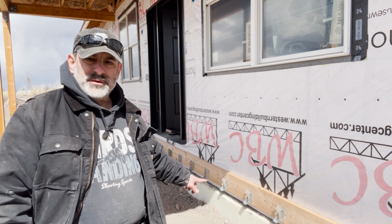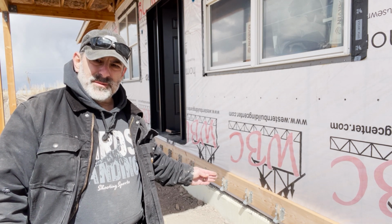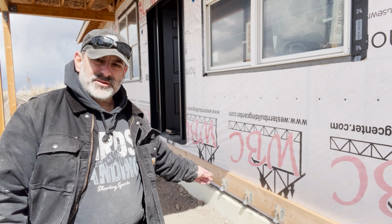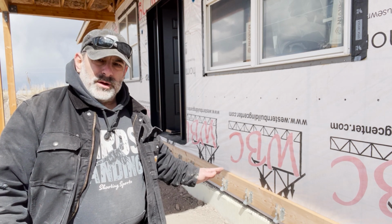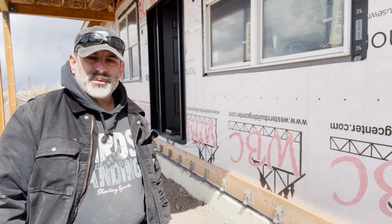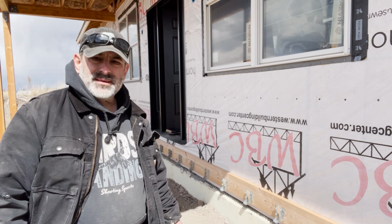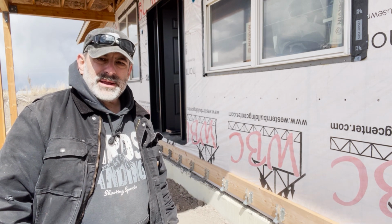The joist hangers are in, like I said, I nailed them on one side. Once I put the floor joist in and even them out, then I'll tack it in on the other side and then nail them to the actual board. So we're all set. We'll start cutting floor joists and stringing those across, but we're making good progress. Like I said, that's not a lot of work, but it's enough to warm me up after a bit.